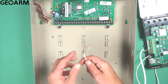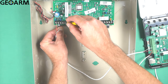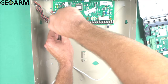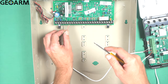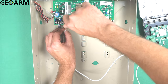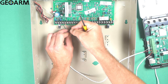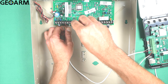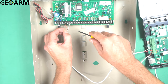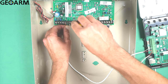You'll want to pull the wire through the back of the enclosure, but I'm skipping that for time. We're wiring into terminals four, five, six, and seven. Terminal four gets the black wire — that's ground. There will be other wires in these terminals already; go ahead and add yours in. Red wire goes to terminal five. White, or yellow if you have it, goes to terminal seven — I skipped six, but that's where the green wire goes. Once tightened down, you're ready to wire in tip and ring.